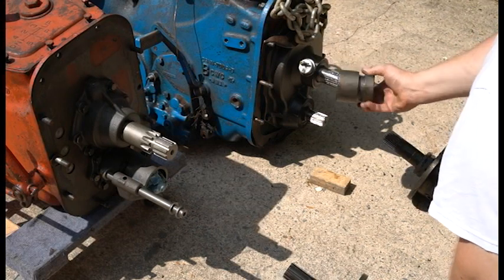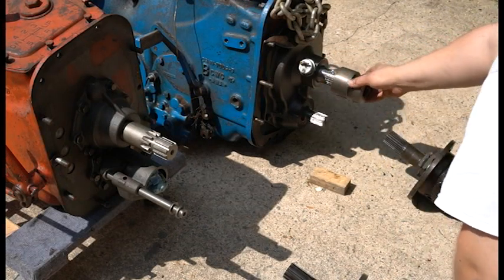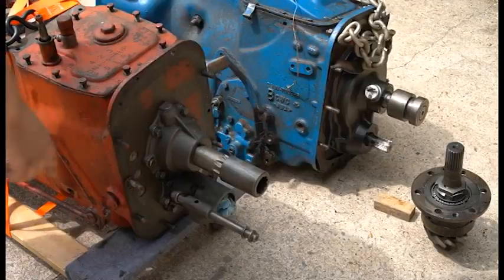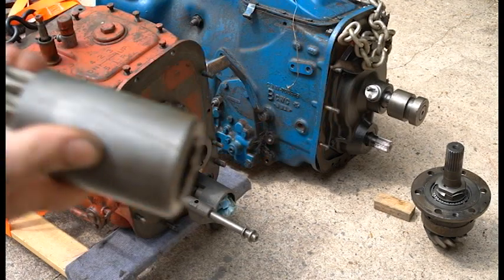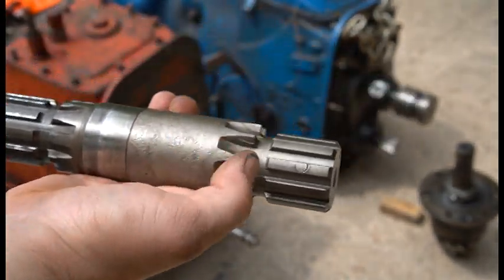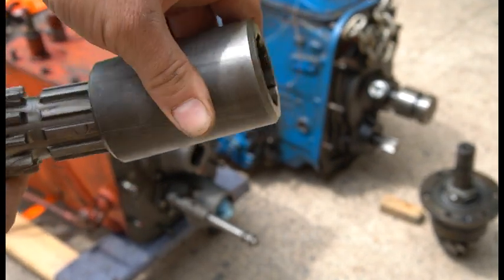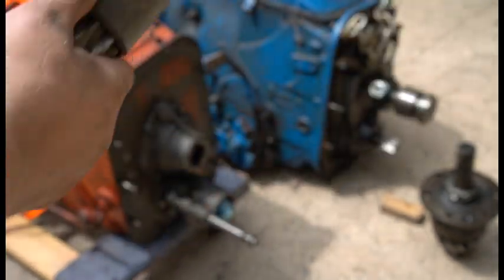The Selecto Speed has a shift coupler that disconnects the driveline using a little shifter plate, so you can move the tractor. On the five-speed we just have a coupler — they actually call that the drive shaft. On the output shaft for the five-speed transmission this part will come out. If you can find an output shaft with the 23-spline end on it from the production change run, that's all you'll need — just that and your coupler. That's the 23-spline option.